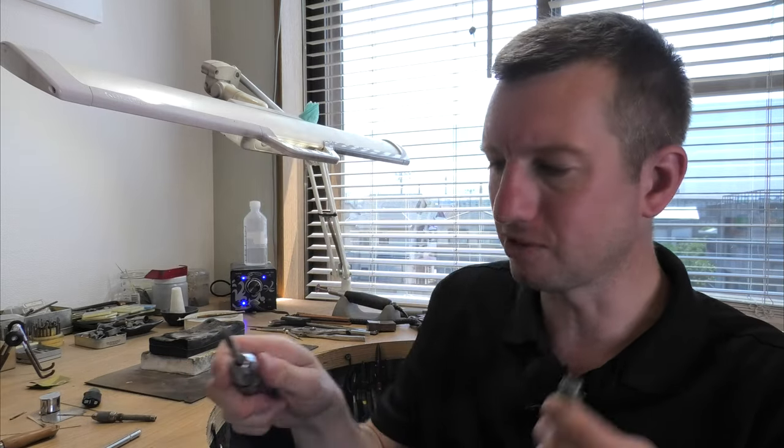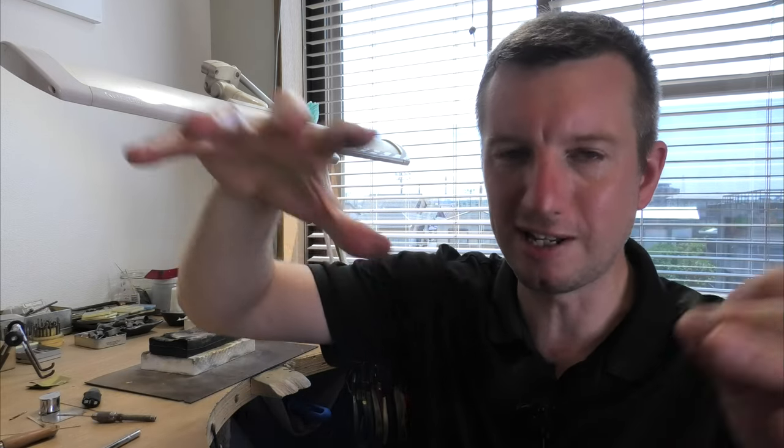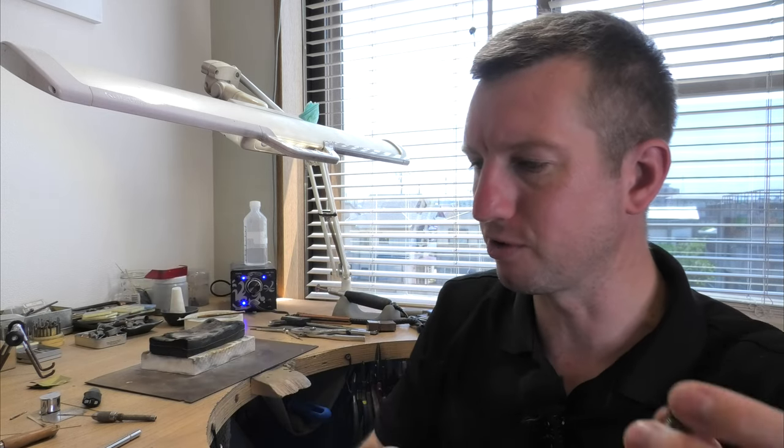Anyway, the thread in the engine is stripped out, so I'm going to try and re-cut it. It's the last chance for this car, because if you can't torque down all the bolts evenly and get it seated correctly, the oil is just going to seep out wherever it's looser. So I need to have a go at fixing that.